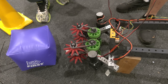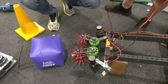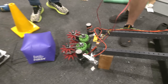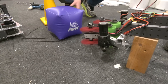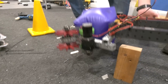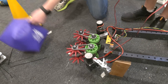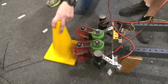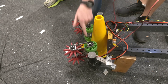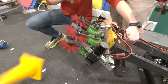It's also a lot lighter weight than the first iteration, which really helps out with figuring out your balancing mechanism based on this thing being at least a couple feet outside your robot. I'm going to go ahead and shove a cube in and you'll see the surgical tubing and how it'll form to the cube. Then we can raise our arm up and outtake wherever we need to go. Same thing with the cone — it will form to whatever way we need it to, and the compliant wheels help grip it in place so it doesn't move at all.